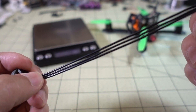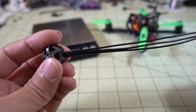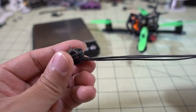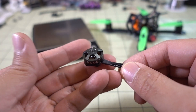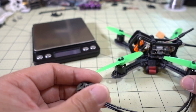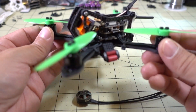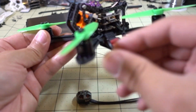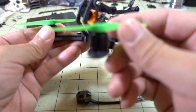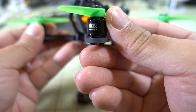One more thing — it has really long motor wires, 150mm. I'm not sure why it's so long. I'm not going to use anything more than a 3-inch prop. What I'm actually planning on doing is replacing the motors on the Acta-Tynu, which I haven't flown in quite a while. It currently uses the Spintek 1106 8000 kV motors.